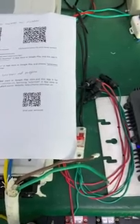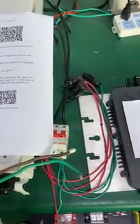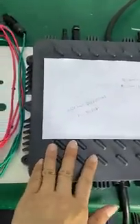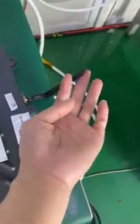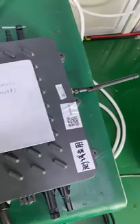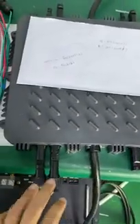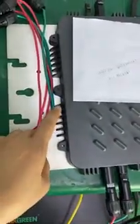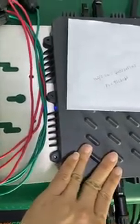Hello, this is Kyle and today I'm going to show you how to configure the microinverter with built-in Wi-Fi module. This is the microinverter with built-in Wi-Fi module. Here is the Wi-Fi module antenna. This one is 1.2 kilowatt. It has the full set of PV input string. This time already connected one set of PV input string. As we can see, the LED is blinking in blue, so it means the microinverter is producing energy.